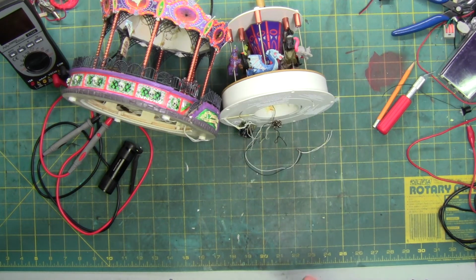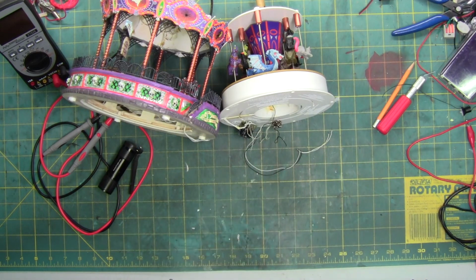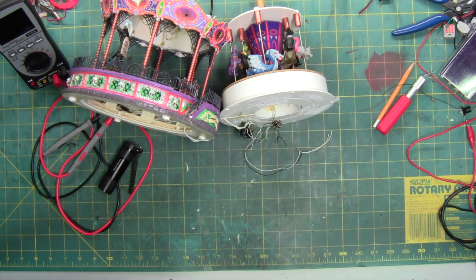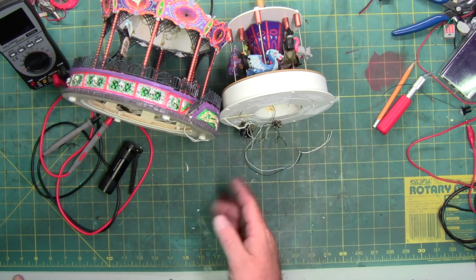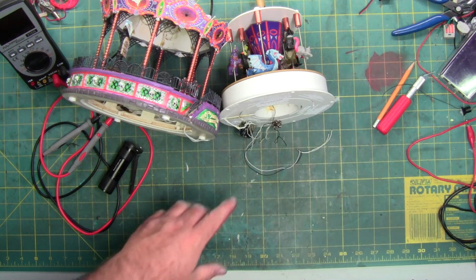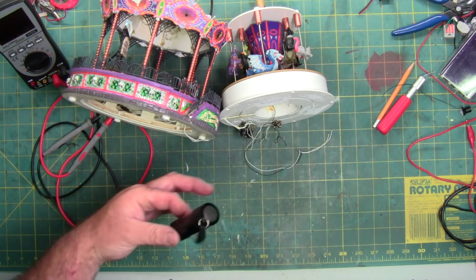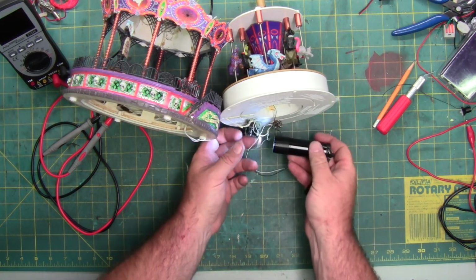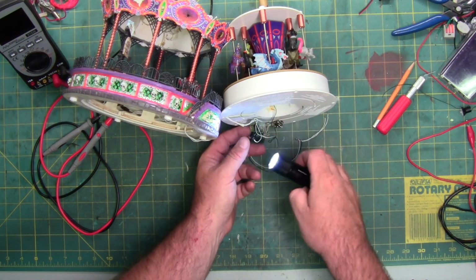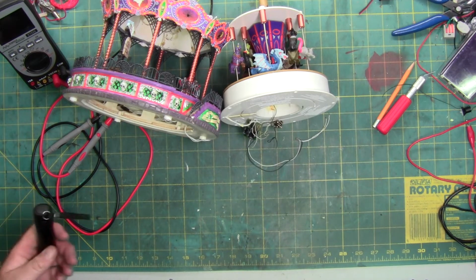How I was doing all the testing was, one, I pulled the boards out as you saw, they're dangling, and wrote down what I could read with a pair of magnifying glasses, because a lot of it's labeled. There's things stamped on it, except that unless you have really good eyes, you're not going to be able to read it. Wrote everything down. Then I took the flashlight from behind, and you can see the tracks. And then I just started tracing the tracks, finding the components, moving them around until I made those schematics.